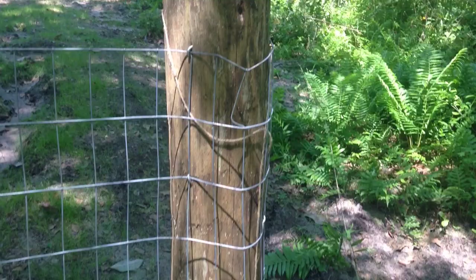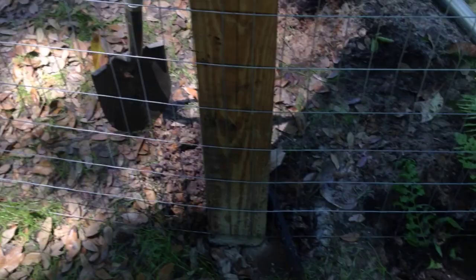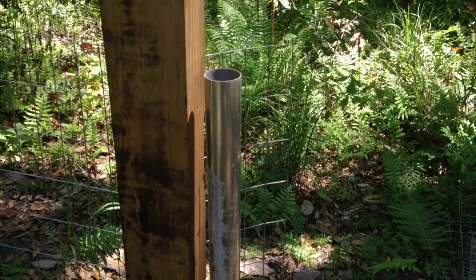A lot of digging these holes. I'm making a hybrid — it's going to be farm fence and chain link gate, just because the gate is easier to adjust on chain link. Had to use the pry bar to get some roots out of that one. I'm going to set these up, take the measurement to make sure the gate will fit in there, pour some concrete, let it cure overnight, and hang the gate to lock.